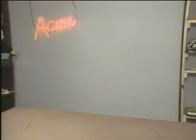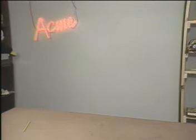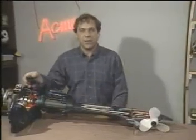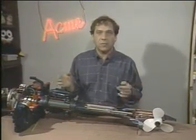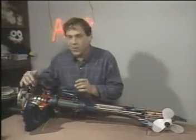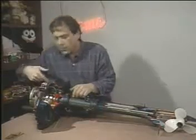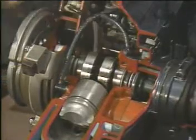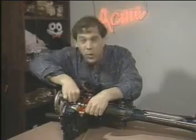There's a way to get rid of a lot of these parts — the two-cycle engine. The two-cycle has no valves, no camshaft, no oiling system. Instead, it has a bunch of carefully located holes and passageways. The carburetor is mounted down here in the base of the engine, in the crank casing. In front of the carburetor are some one-way reed valves.